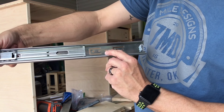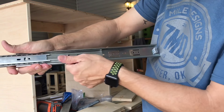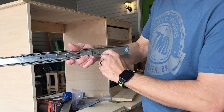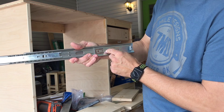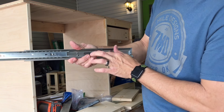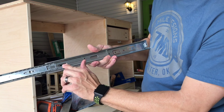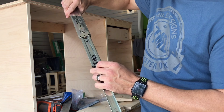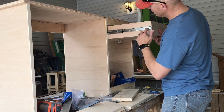In case you've never used ball bearing drawer slides like these — they glide extremely smooth. When I mounted them I used the slotted holes for the first two or three screws. This piece attaches to your frame via the slotted holes, and I put them right in the middle so all I had to do was back off the screws a little, shift it back an eighth inch, and tighten back up. Once it's set, I go in and put a screw in the round holes, not just the slotted ones. These slides pop out — you just flip that little lever up or down and the drawer slides off so you can attach it completely.